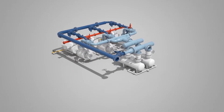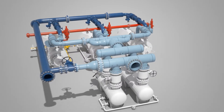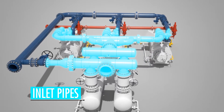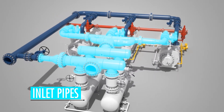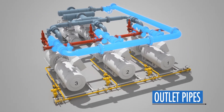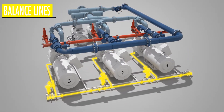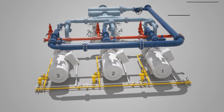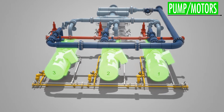A multi-phase pump system is comprised of the inlet header, which is specially designed to provide equal distribution of flow to each of the multi-phase pumps. The system also includes the outlet piping, instrumentation, and a balance or equalizing line that interconnects the pumps to assure liquid filling of each before startup. The pumps and motors form the heart of the system.